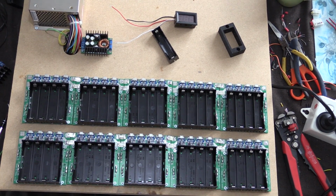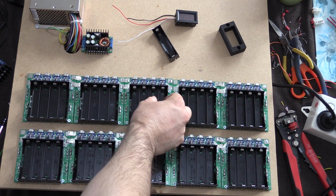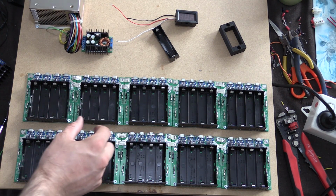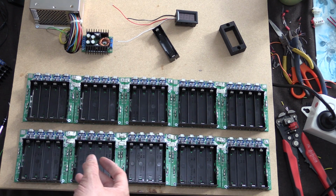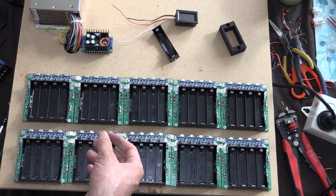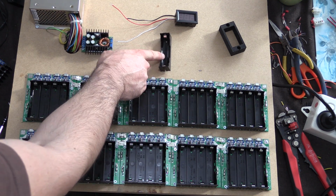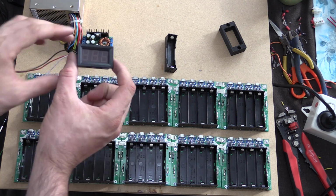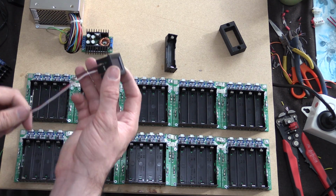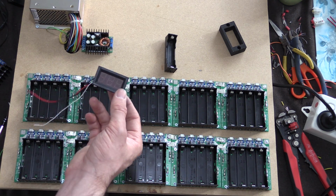Okay, so now that that's all working, the last thing I want to do is actually put a little multimeter on, so that way if the cell's not going to charge, I can throw it into a meter and test the cell. Now that's exactly what the amazing charger thing that's been sent around has got on it, and it was absolutely fantastic. I'm going to use just a standalone 18650 holder. I've got this that I've used in other projects, so I'm going to reuse this one. So this is a 100 volt one, which is way more than I need for obviously testing a small cell, but we're going to use this since I've got it lying around.